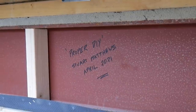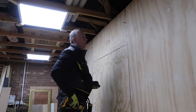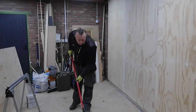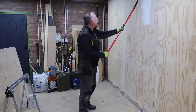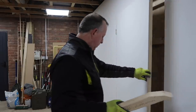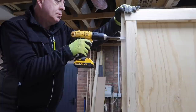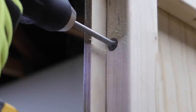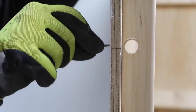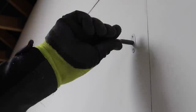Once the door was on I could fit the very last panel above it. The primer I'm using here is Leyland Trade Acrylic Primer Stroke Undercoat, which works well for me. Just to finish the door off I jam it open with a piece of timber so I can fix two simple security bolts — one top and one bottom — just to hold it closed. These aren't really for security as the outside door will do that; it's just the cheapest way I came up with to fix it in place without having any door handle protrude into the workshop. I mean, I'm rough but not that rough.